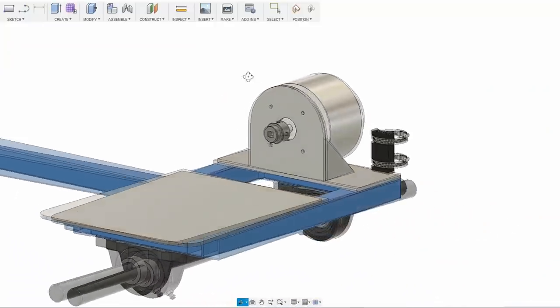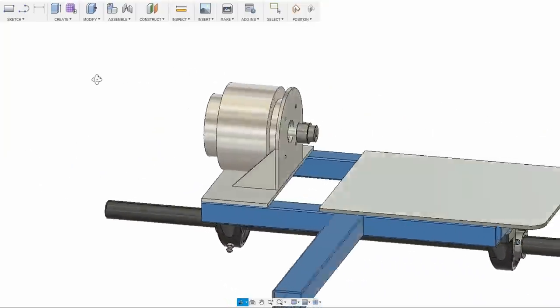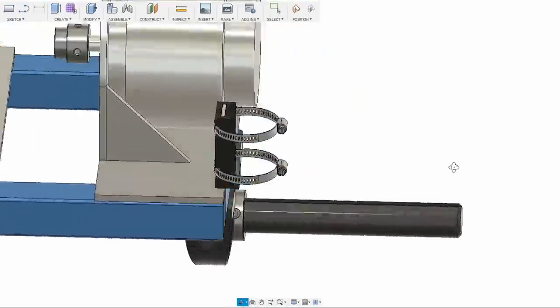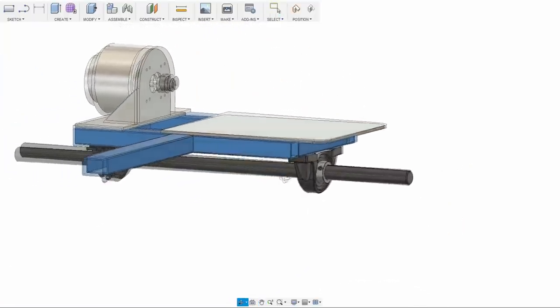Okay, so here's the motor mount that I modeled up in Fusion 360. My brother has some 3/16 stainless steel left over from a job he did, so that's what we'll be making the mount out of. I also designed this other small mount for the water reservoir to clamp onto, and I offset the aluminum plate over the edge a little bit in order to leave a space for the chain.